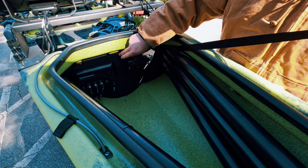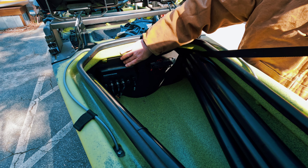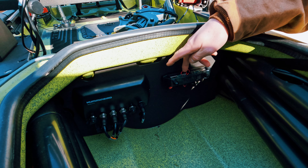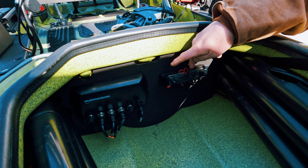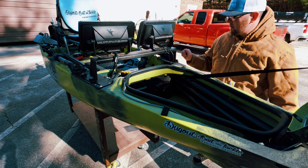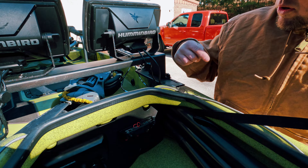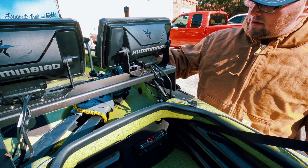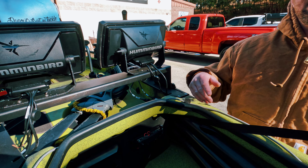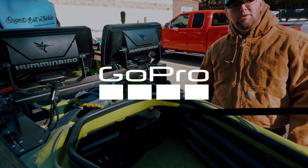So here we got the Tim Percy mounting plate. We got my Hummingbird Ethernet switch panel. This is where my power runs through — my two main poles are here and all my electronics are screwed in here. It's real nice and clean. My Mega Live cord is run through here — we drilled a hole because with the Hummingbird, you have a short cord. So I can disconnect it here — my power, my Ethernet — and pull it back into the kayak. That way I don't have to worry about the ends of my cables getting corroded.